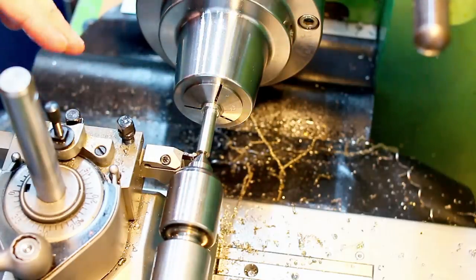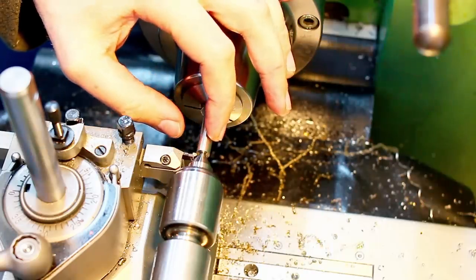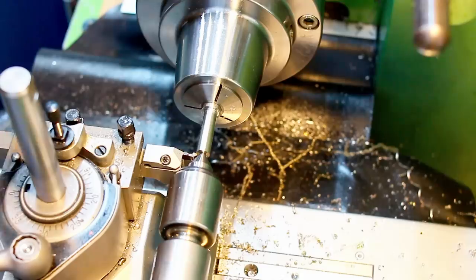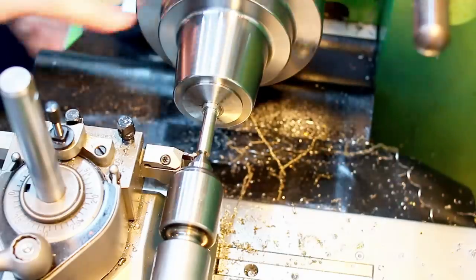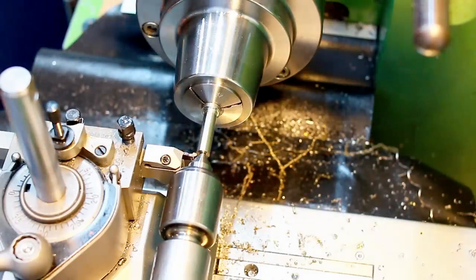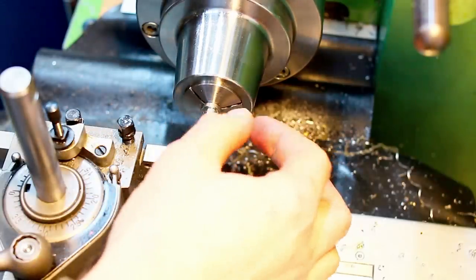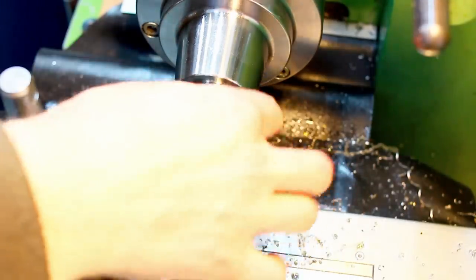That's something to consider. I started out, I did all the roughing dry, and at this point I would need to add coolant because the cut is behaving so badly that coolant will be a great improvement. Also, the part is getting fairly hot, which is a problem for the precision cut on the end. This definitely needs to cool down because I can't touch this very long.